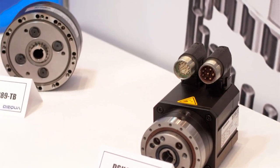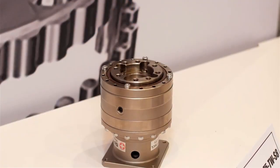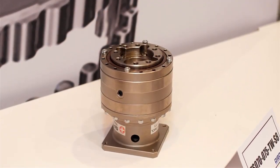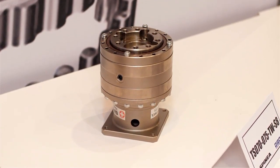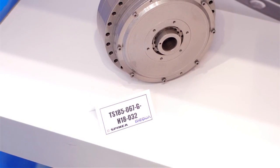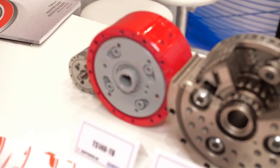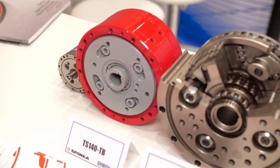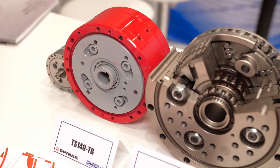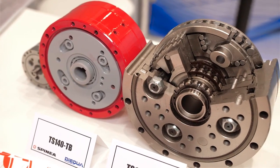However, we're here also to find some other additional niche markets like machine tools, like surgical robots, or any application that requires an absolute zero backlash and very smooth operation. The other thing that makes the cycloidal gearbox very interesting is the internal bearing structure. It uses a cross roller bearing that allows it to have very high axial, very high moment, and very high tilting capacity.